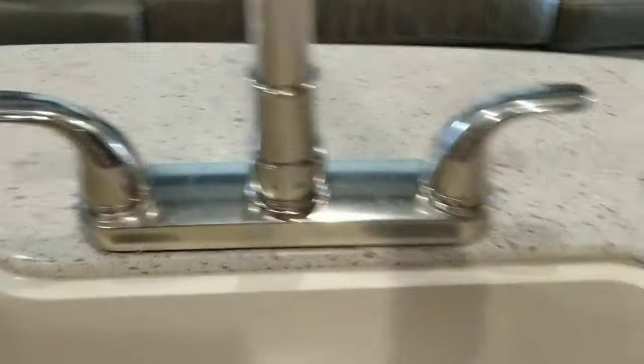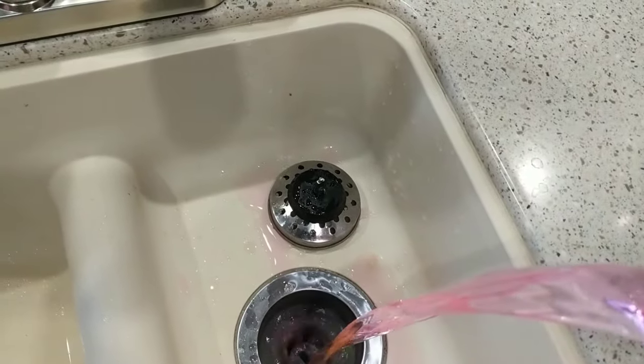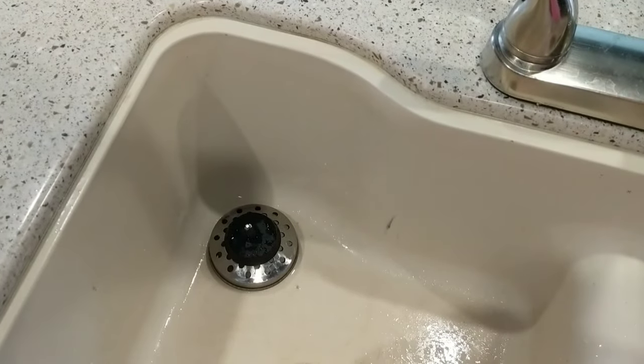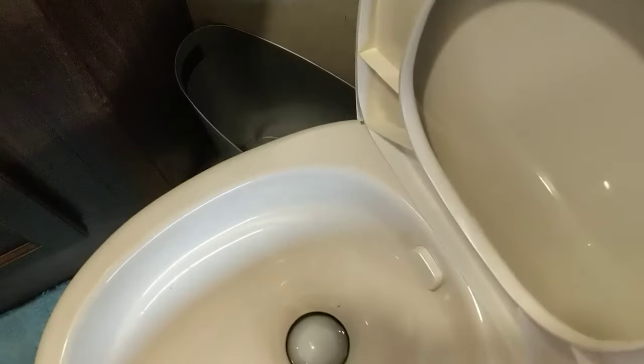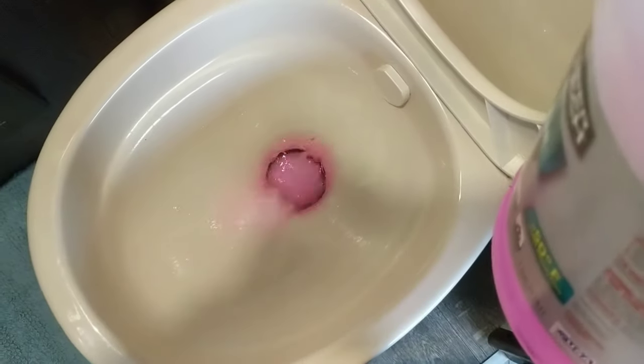Now when we do break out the antifreeze, all we're doing is hitting the traps — about a quarter to a third of a gallon in every trap. Also make sure you always put it in the toilet to keep that seal lubricated and keep the antifreeze in there. I usually drop just a little bit so it gets down in there. I used two gallons of antifreeze amongst four sinks, two toilets, and a bathtub. That way everything's done — the only place I have antifreeze now are in the traps and the drains. Come springtime when we break the camper out of storage, our fresh water lines are clean with just fresh air — compressed air went through them — so I don't have to worry about flushing the system or tasting the antifreeze. First time we go out camping we're good to go with fresh water. If you like the video, click subscribe for more DIY tips.